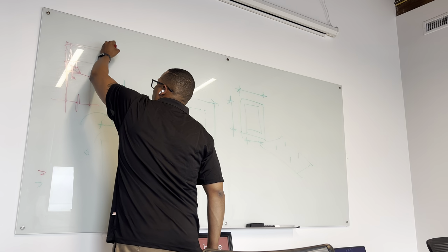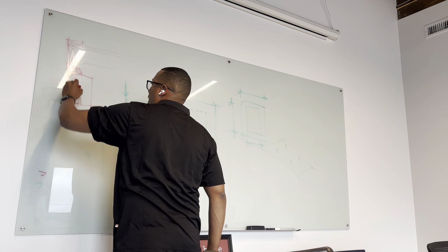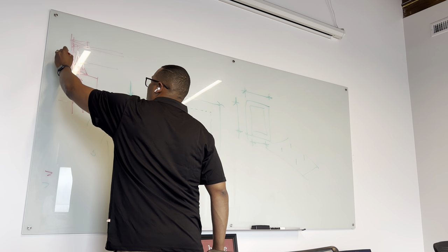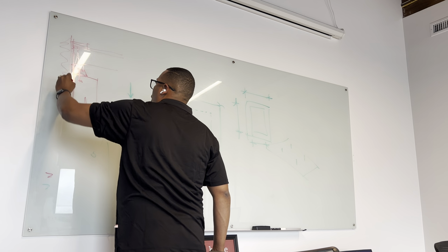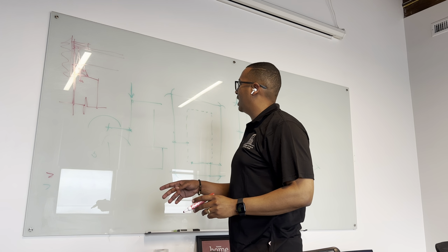You're going to have your band joists. You're going to have your plywood platform frame. You're going to have your bottom plate. That continues to be aligned. That's a critical alignment. Everything else comes after. Your sheathing comes after. Your siding comes after. All of that comes after. So this alignment is critical. This tells them how to put the whole building together. That's why it's so critical.